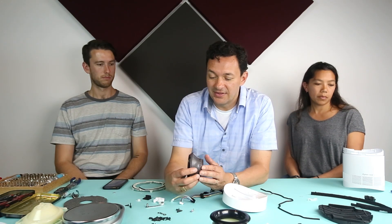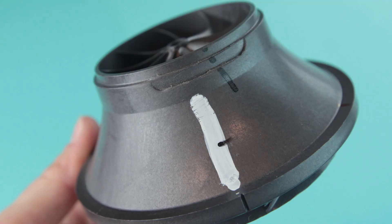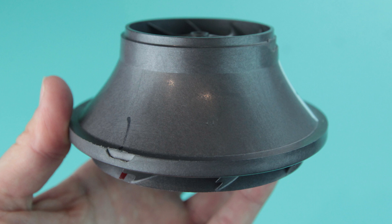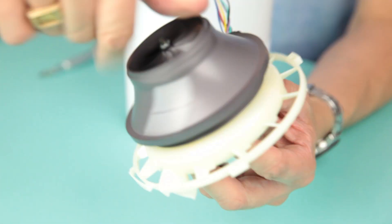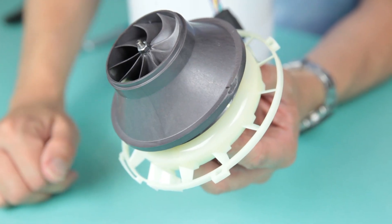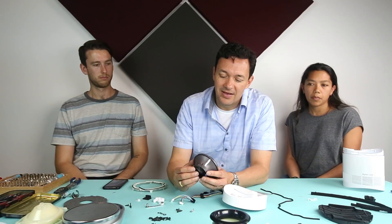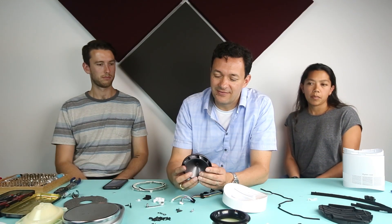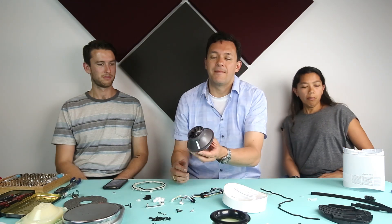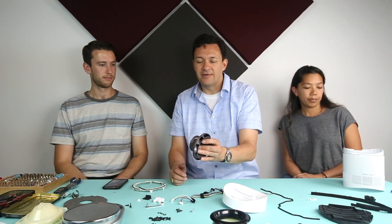What's really cool is that they dynamically balance it — these machining marks over here are evidence that after injection molding and after assembly, they spun this up in a machine and dynamically balanced it so it wouldn't vibrate when running. That removes a little bit of hum when it's spinning, which is a very interesting feature of this fan. It's obviously more expensive than conventional injection molded parts.